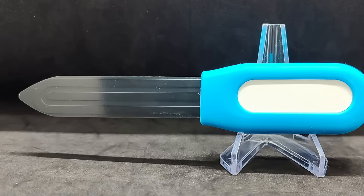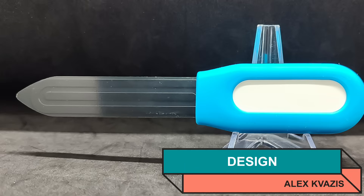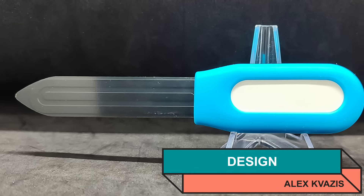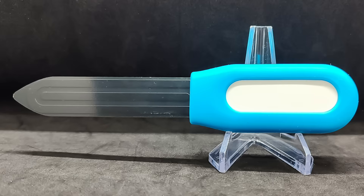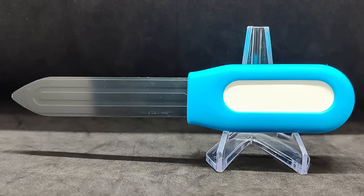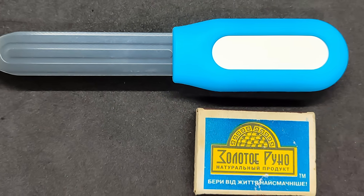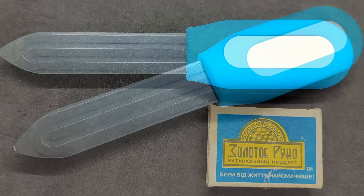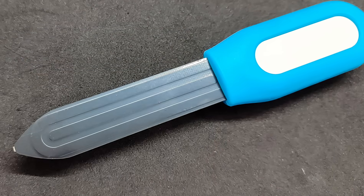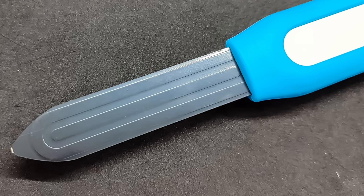The device consists of two parts: the sensor itself, which is a module measuring 77.5 by 33.5 by 21 millimeters in a silicone case that protects it from water droplets, and a probe measuring 84.5 by 30 millimeters, which is inserted into the soil. On one side of the probe you can see the conductors used to measure soil moisture levels. The temperature sensor is located in the main body of the device.